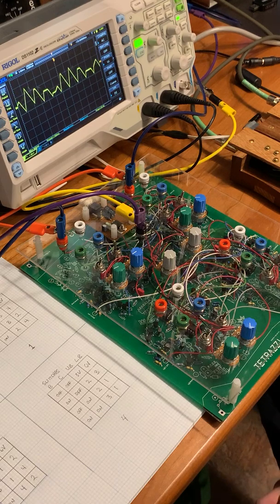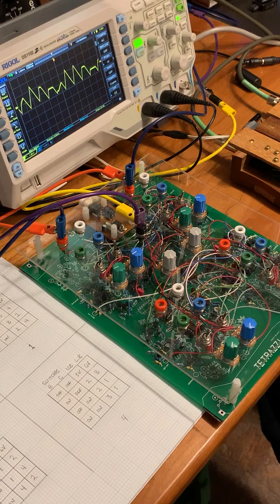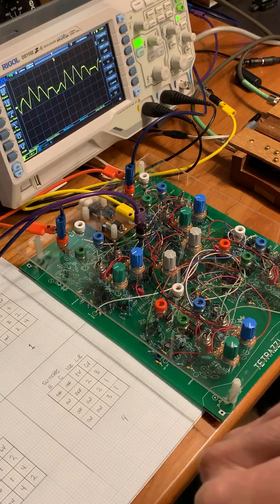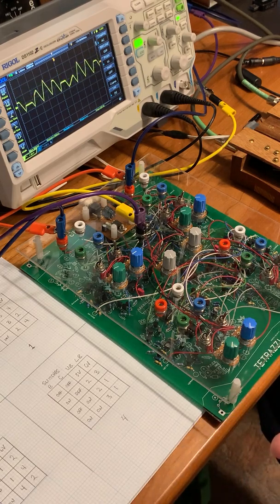You can see that there's quite a variety of waveforms obtainable just from controlling the bounds and the frequency. In this case, we were just controlling the bounds. But as the bounds come close together, it takes less time to reach the boundary, and that increases the pitch as well. So bounds modulation affects both pitch and shape.